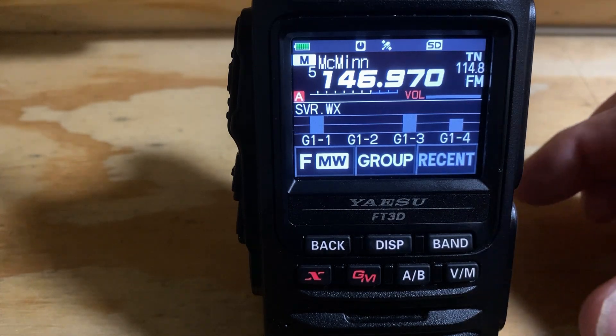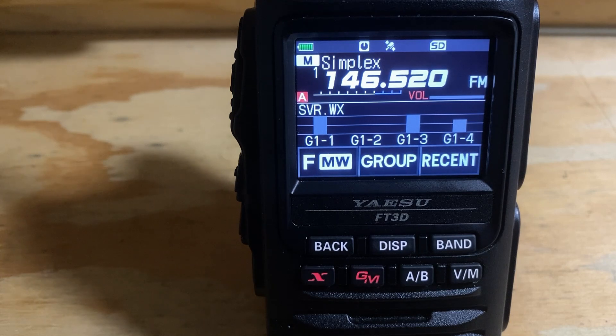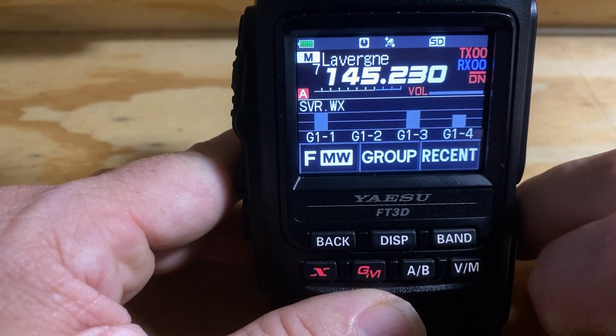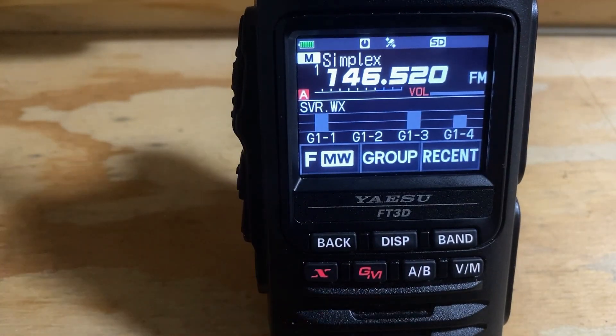It doesn't play any of the audio, but you can simply touch on one of those to immediately jump over to that particular frequency. In my CAM group here, G1-1 is 2-meter simplex. From another radio, I'm going to go ahead and key up the 2-meter simplex frequency, and you'll see that the scope lights up right there. If you want to go ahead and jump to that frequency, you can simply touch that portion of the screen, and it will automatically load up that particular band for you. If I touch one of the others, you can see that it loads up different repeaters. So it's really useful if you want to monitor several different repeaters. This isn't only useful for severe weather — you might use it for other things when you want to monitor several frequencies at one time.